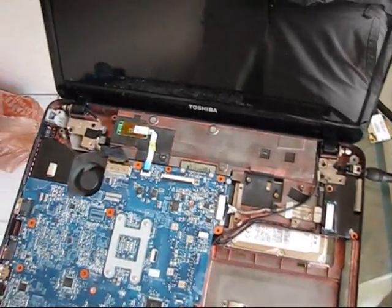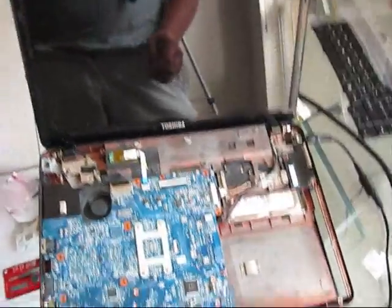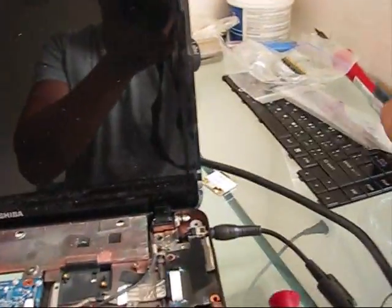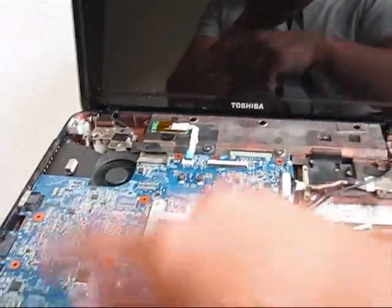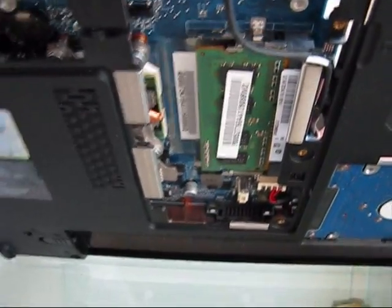Or I have to try replacing the RAM modules, because if you have a faulty RAM module or faulty CPU, you will get pretty much the same result. Trying to replace the RAM modules and disconnecting power — it's doing pretty much the same with or without the module. Currently the RAM module is installed, and if I remove the RAM module, it does the same thing.